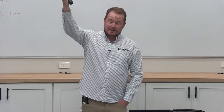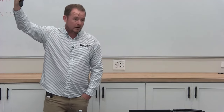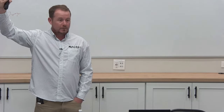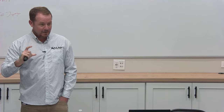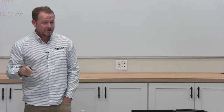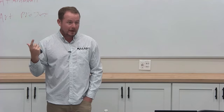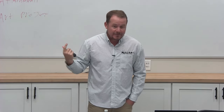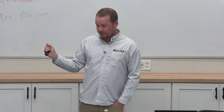Well, I do have a carbon monoxide detector. It's that one. Yes, and that one will not alarm until over 100 parts per million. That will alarm when you're about to die. We would like you to be well below that before you're alerted. And so this is battery powered. Batteries usually last about 3 years. You just have to replace it every 3 years. Here's how much it is. I'd just like to make you aware of it. If the client doesn't accept it, that's fine. But at least now we have that documented. Do you see the value of that?